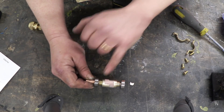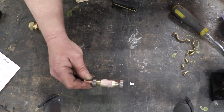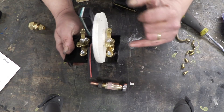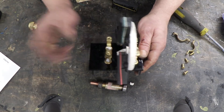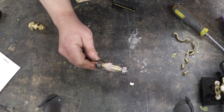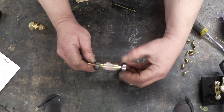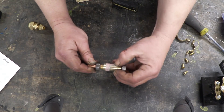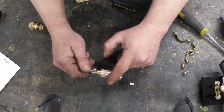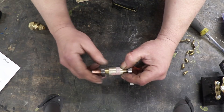This bit of resin keeps the two halves separate — that's the positive side, that's the negative side. That contact is actually made through the Munson ring, so we connect there and there, positive and negative, giving us a positive-negative side. It connects through that ball bearing to the central brass pipe, to this half of the commutator making that side positive. Exactly the opposite happens on the other side making that side negative. The reason this is a bit of pipe is I can put a motor drive in there and use a small DC motor to drive it.